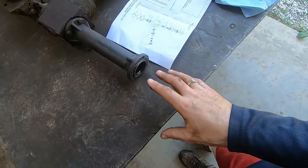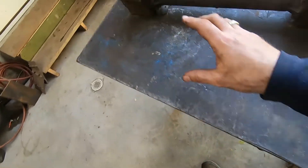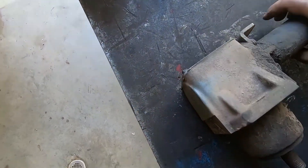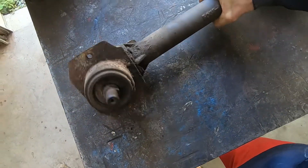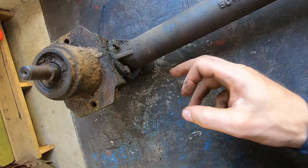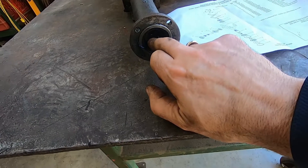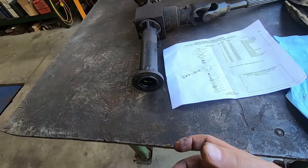When it comes to disassembling — the gearbox looked just like this one and we knew which one was the problem because we took off this little cover right here, four little screws to take it off, and we could see the broken teeth in there. To get these gearboxes off there are one, two, three, four bolts that come out, then it slides off at this angle and you'll see a little toothed collar that the shaft goes into, and then you get the gearbox in your hand.